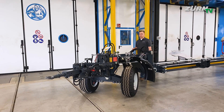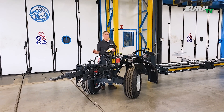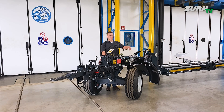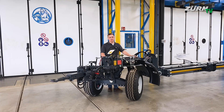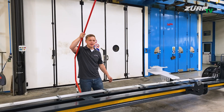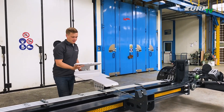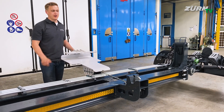Another important feature on this trailer is the four-wheel steering. This is very important when you want to go around narrow corners. From the steering front axle there is a master cylinder pushing the oil back to the rear axle where the wheels are also hydraulically steered. When the header is loaded centrically, with this handy indicator you can lock it into place with the transport lock — just one lever clamping the mower bar and at the same time locking the rear transport lock.